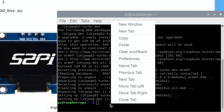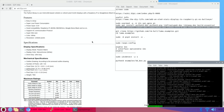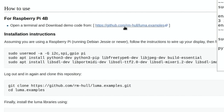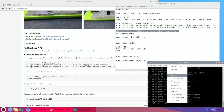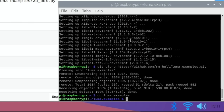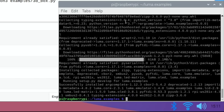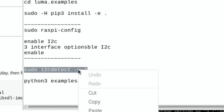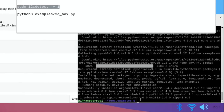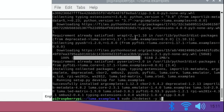I thought the first bit might be enabling i2c but it doesn't seem to, so we'll do that in raspi-config in a minute. Let's just copy each line in and say yes to that and yes to that. Weirdly in the guide it directs you to download this code but then gets you to download it anyway. Let's copy the next bit and then run sudo pip3 install. I've also put in this line which tests the GPIO pins.